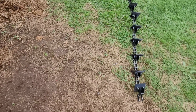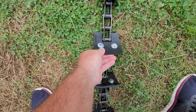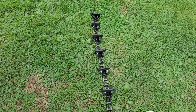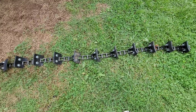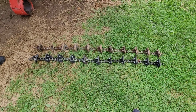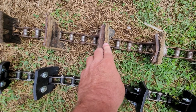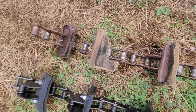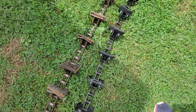If you turn around here, here's the new one laying on the ground, and you can see all these paddles are thick and heavy and new, and this has to do with the rethresher. It's not a highly efficient combine in terms of what's out there on the market today in the computerized world, but it'll be as efficient as it was new. It's going to give you a little better perspective. You can see here, new, old, frayed, chewed, not chewed. Just doing stuff like this to an old combine makes a big difference in what your sample looks like.